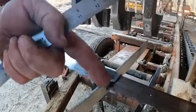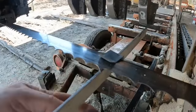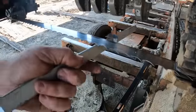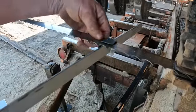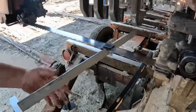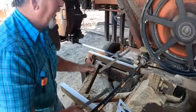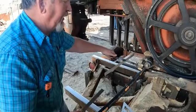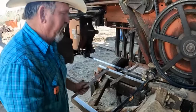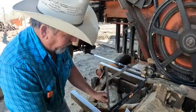The next step we're going to discuss is the blades themselves. A lot of people complain about blade breakage — the majority of the time if you're getting blade breakage it is because of improper blade guide roller alignment. You're putting that blade in a bad position, putting extra friction or torque on it, causing extra stress and fatigue in that metal. So we're going to discuss some blade guide alignment techniques.